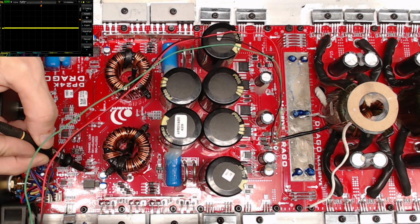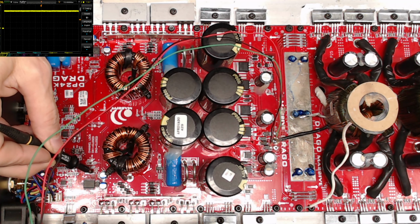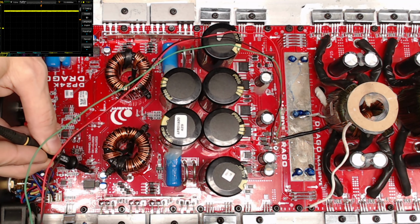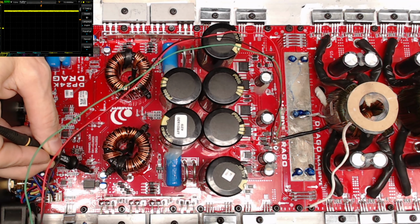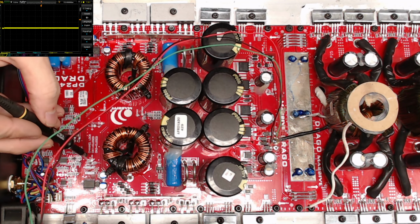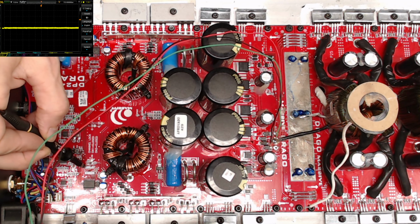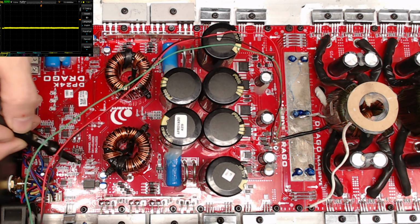I have the plus 15 volts, which I do believe was pin 14, right? Yes, pin 14 of the, I call it flip-flop. I have to double check the data sheet, guys. But I do believe it is a flip-flop, a CMOS flip-flop. So we do have our positive 15 volts for the power of those flip-flops, and pin 7 is your ground, which we see no obvious issues with.